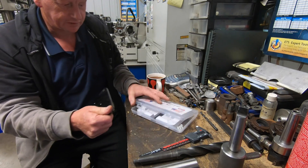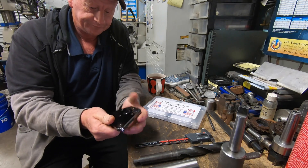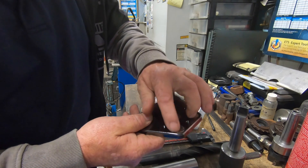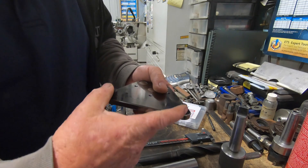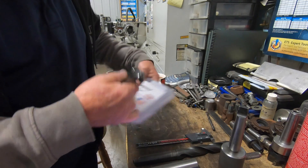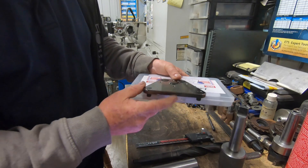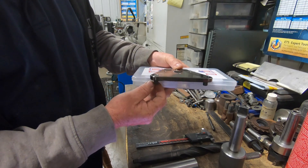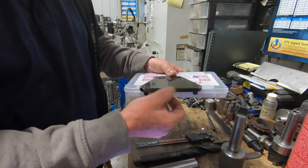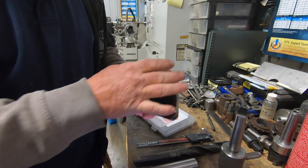This is a 4-inch model. They come in 6-inch, 5-inch I think. They've got rare earth magnets and they're bloody strong too. These pins are 4 inches apart exactly. So it sits on the top of your compound slide and you can space the gauge blocks or whatever you're going to use to get your right distance. Then you can indicate off this edge.